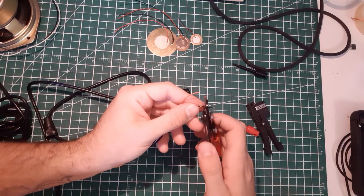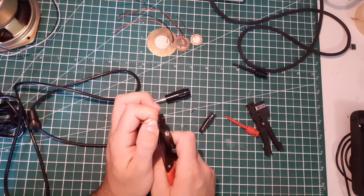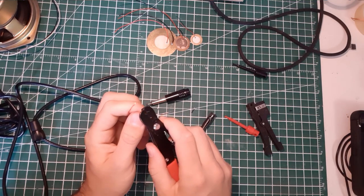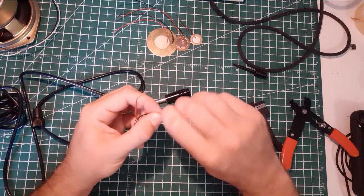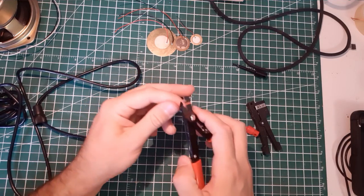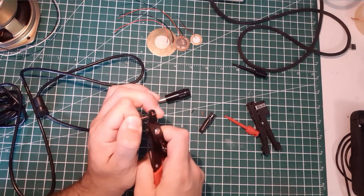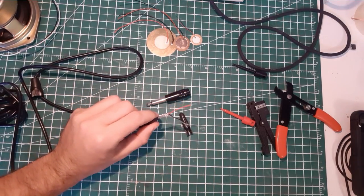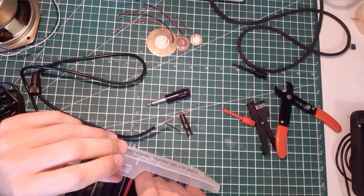So make sure you cut about this, yep, black wire. Skin gently, they are pretty small, so I'll get a longer one. Yeah, that's good. And if you can, you twist the black core with the shield, then I'll cut a bit of the red wire, skin it gently. I don't want this to be left like that, so I'll add a shrink.